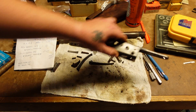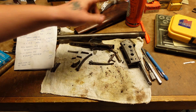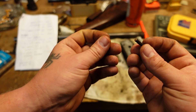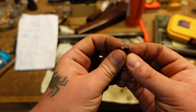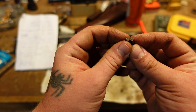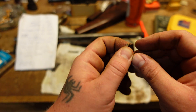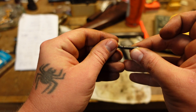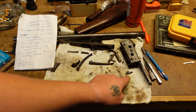Also, on the receiver, the reinforcing pin — after cleaning it up — turns out it was split. I assume that happened when they went to re-chamber or drill out the old barrel, when they put it in a vise or something. This pin was completely split and sitting in the receiver. So we're going to need a new one — we'll make a new one.